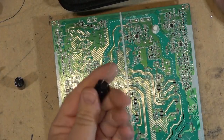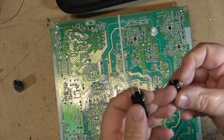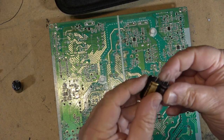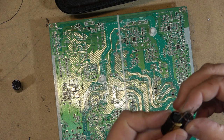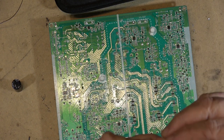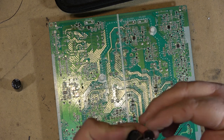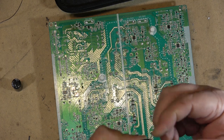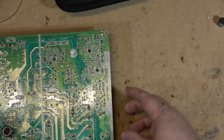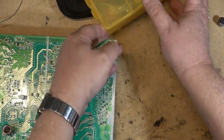I don't have a 1500 microfarad cap, but I do have a 1000 and a 560. If I pair those two together I'll make 1560 microfarads, which is more than enough. So I'm going to have to bend the leads over and connect one to the other. This one here — the leads look to be relatively short, I wonder if I've got another one with longer leads.